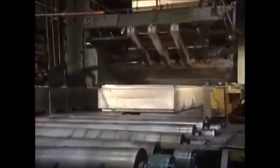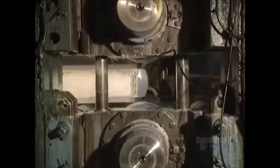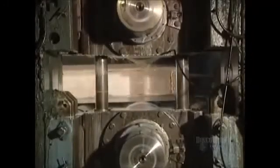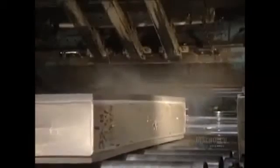The many steps in the thinning of the ingot begin. The aluminum block is crushed by the hot mill rollers. Temperatures in the rollers are between 455 and 540 degrees centigrade. Pressure on the ingot is continually verified by a technician — if too great, it's lowered and the technician adjusts the pressure. The heat is so high that the ingot risks sticking to the mill's roller, so everything is cooled with a liquid that's 95% water and 5% oil.